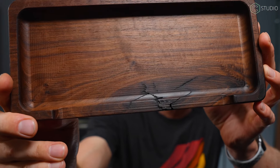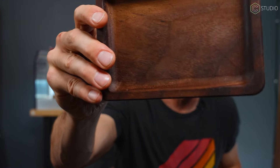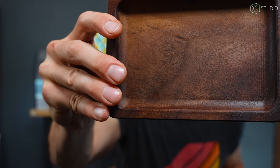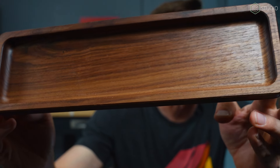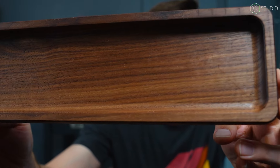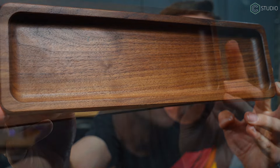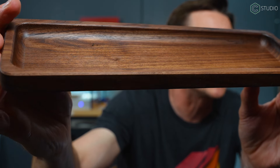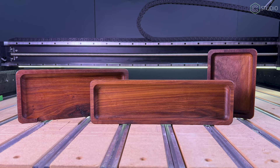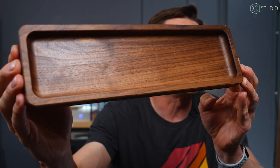You can also see the machine marks on the first one — I sanded it and they're still quite prevalent. That was the first effort. The second effort looks much cleaner, but some sanding was still done. So I knew with that finishing pass things were going to be better — I didn't know how much better. I was totally blown away by the impact. That finishing pass, that small stepover, that 0.5 millimeter final depth — I did zero sanding in the pocket of that tray and it looks wonderful. Look at those transitions from the vertical to the horizontal faces — beautiful. You'll immediately get compliments, because of the geometry of that bowl bit really coming into play to make something exceptional.